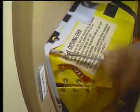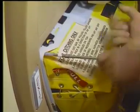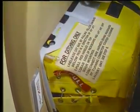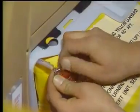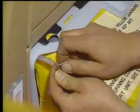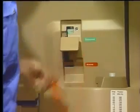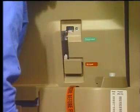Carefully tighten the two stud assemblies with the Allen key until there is no play between the door and packboard assembly. Connect the two pull handles to the stud assemblies with the attach links. Remove the safety pin from the emergency control handle and set the handle to the armed position.